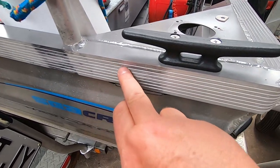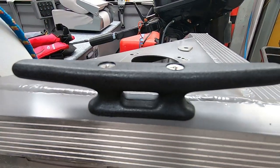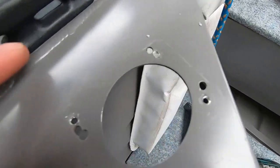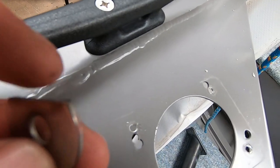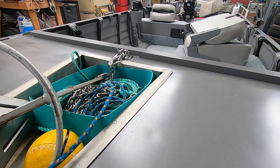It's going to be fun trying to drill a hole underneath this rail - we may be able to sneak through there. Just a matter of drilling a couple of holes into the gunnel, a couple of big washers underneath with some lock nuts - that's pretty much it. So there's the cleat mounted. Just got to be careful there's no cables underneath - there's actually a light under there which we were lucky enough to miss. On the other side the big flat washers were too big so I've just trimmed off the side of one of them so they fit up underneath the gunnel. They've got a nice big washer and a couple of lock nuts so they won't go anywhere.